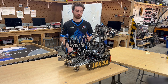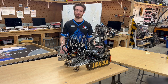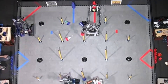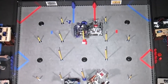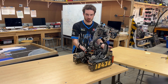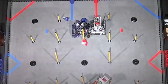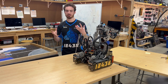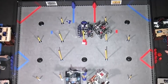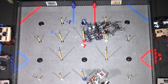A really obvious example of this is when you use position in conjunction with time and you can get velocity. So for the example where we were pushed out of position and drove away and drove back to position, two things had to be true at that point in time. The first was that we were no longer in position, and the entire robot contracted. The second was that while it was still attempting to reach position, it recognized its velocity was zero, meaning another robot was blocking it and the only way to get back to position would be to drive away and come back.